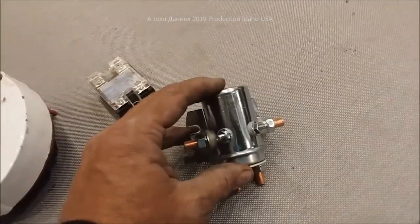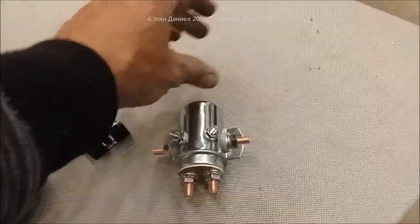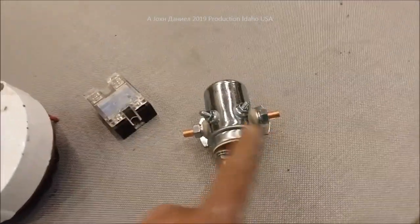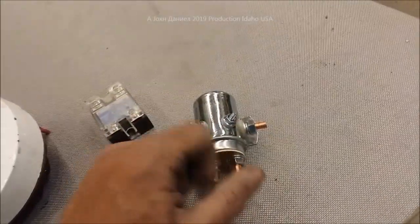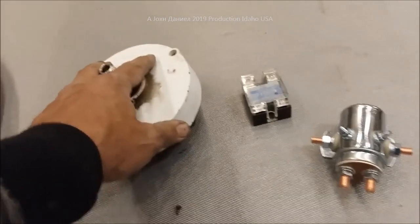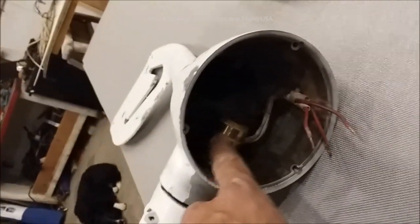This is just a cheap part — dirt cheap. I can get these from AliExpress for like six bucks, and the guy in the Midwest is selling these things with a little controller that looks like a little brain, a little digital display. What it does is it diverts your power — that thing will kick on for like five seconds at a whack and just pull your batteries down to nothing. In the meantime it's causing a massive load on this, because when the amps in that battery get drawn down real hard, that turbine is trying to keep up.